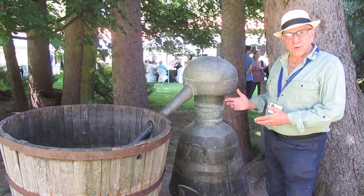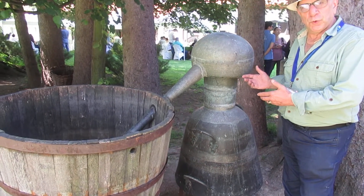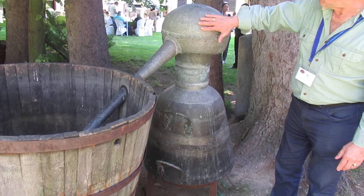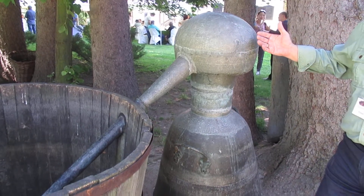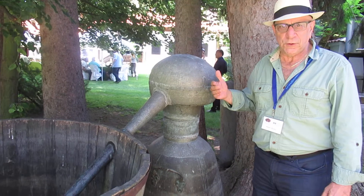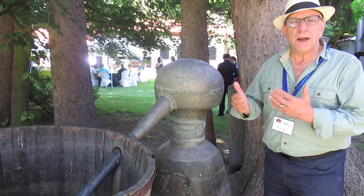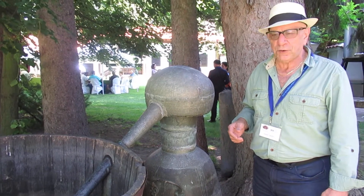I just wanted to show you this incredible piece of equipment. This is how they used to make rose oil and rose water. This is a copper system, and you can see that the color on the top here does not look like copper, and that's because it's tin coated. The reason it's tin coated is because copper will react with rose oil during the manufacturing process — it will turn your oil green. The tin forms a lining around the copper, and it keeps the copper from reacting with the essential oil.